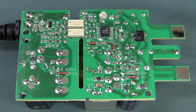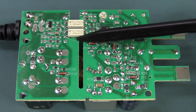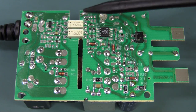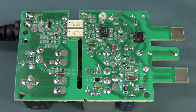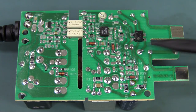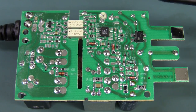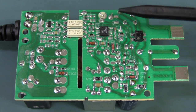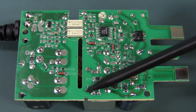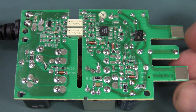Look at the bottom side. The first thing that strikes you is the clear delineation between primary side over here and secondary side. Massive isolation slot down in there — not only just the isolation slot, but the physical creepage distance there. And these big, long opto-coupler packages like this for extra voltage isolation. The reason they're that long is probably because they're 4 kilovolt rated. I believe the specs for these things is 4 kilovolts clearance between primary and secondary — I could be wrong, but it's much higher than usual. Just look at that delineation — absolutely enormous. They've got the slot cut out in here and the traces all the way back. They haven't just auto-routed them willy-nilly. Really absolutely incredible.